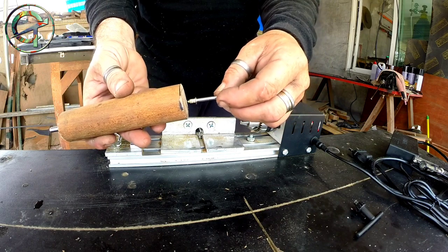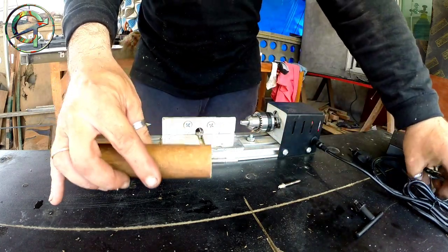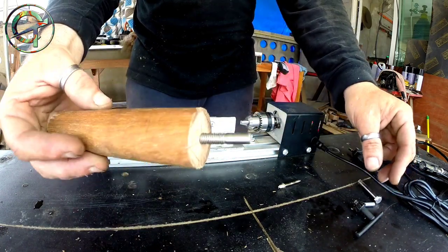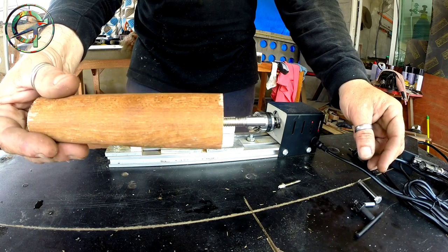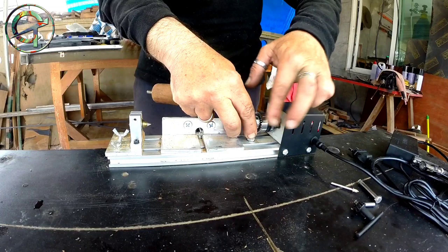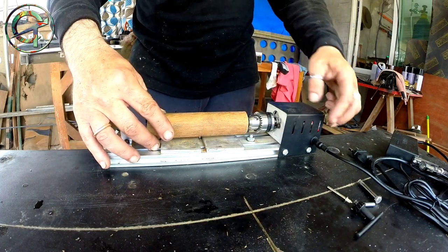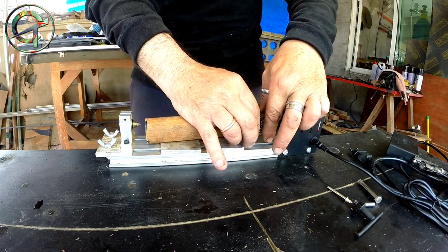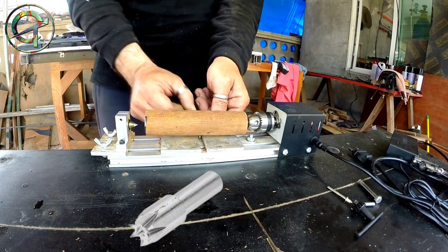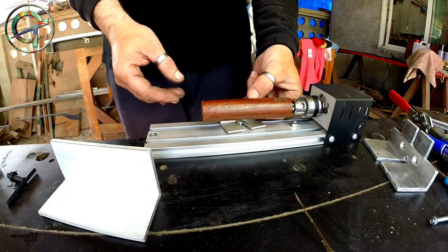The first accessory I don't like is this screw needle to keep the piece firm in place from the chuck side. I replaced it with a bolt that I simply cut — this way I have a thicker diameter needle with a much better grip. The original screw needle that comes with the lathe simply doesn't work: its thread is too short and sharpened. After a few minutes turning, the needle heats, breaks the timber fibers and the piece loses its grip. I'm waiting from Lazada for a 6 mm timber drill bit dead center that will replace the bolt needle — hopefully giving a better overall grip.